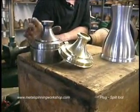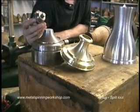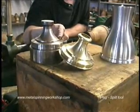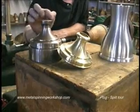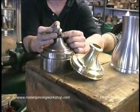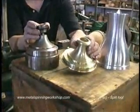If we look at the mandrel and how it's been made, it can split into two sections, and then it gives you this nose or the plug at the end, hence the name plug tool or split tool. And what happens is the spinner will spin down the entire contour of the shape that it requires, like he has done here, and then cut the nose out and remove the shell, which we can do, but this plug will still be set inside the shell. This plug is then knocked out of the shell, leaving this shape.